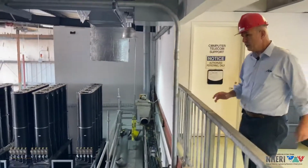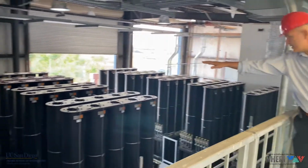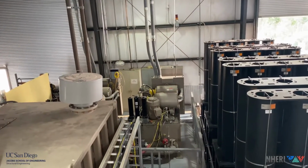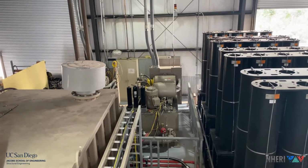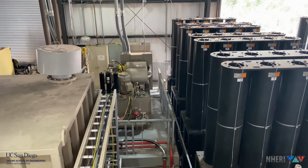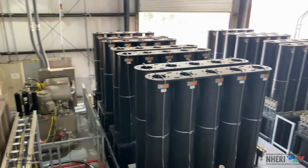So here we have a very good view of, first, the 2 existing pumps. One of them is going to continue to serve as the pump that is feeding all the pilot flows to control the spool of the servo valves. And the second pump will also be used to pressurize the accumulator bank. So we will now have 3 pumps to pressurize the accumulator bank.